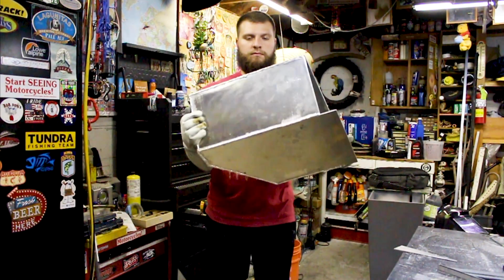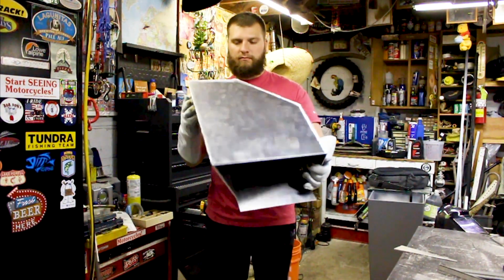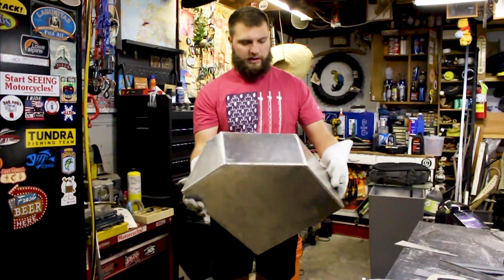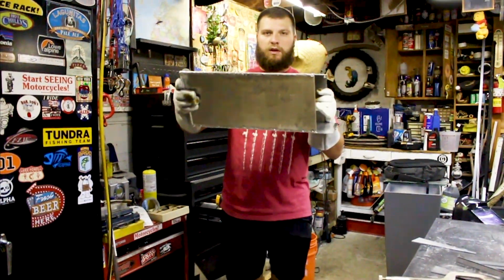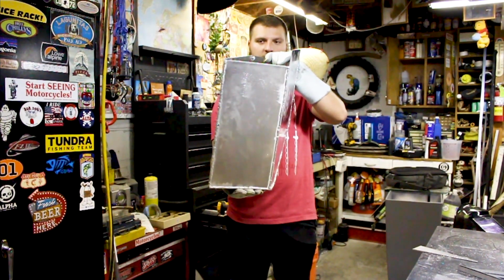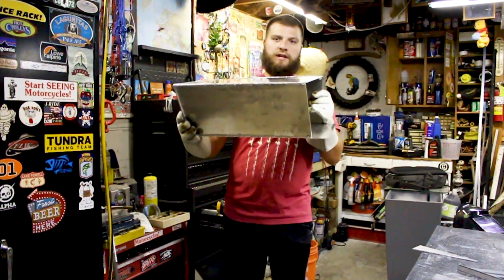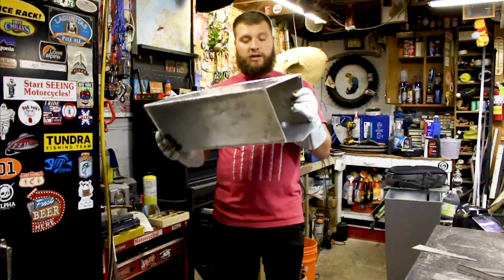Okay guys, pod's all welded together. There's the inside of it. What we're gonna do is just put it up against the boat, make sure that it's tilted just a hair. That's why we have that much overhang, to compensate for the angle in the transom, plus the angle that it needs to mount to the boat. So follow me.